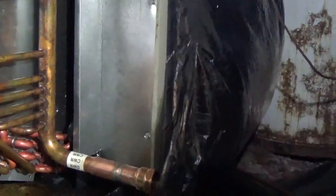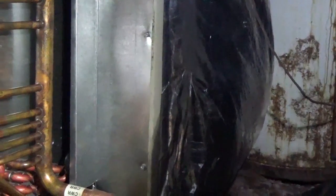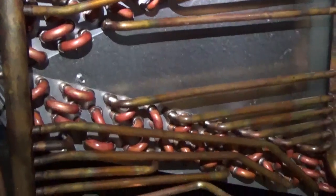We took a piece of sheet metal to lock the coil in, put some screws in, and that's all we had to do to get that five-ton hydronic coil into a four-ton space. It goes a lot taller and longer than the other one, but everything seems to fit okay.